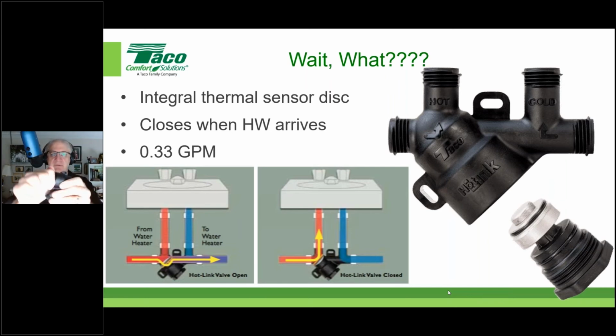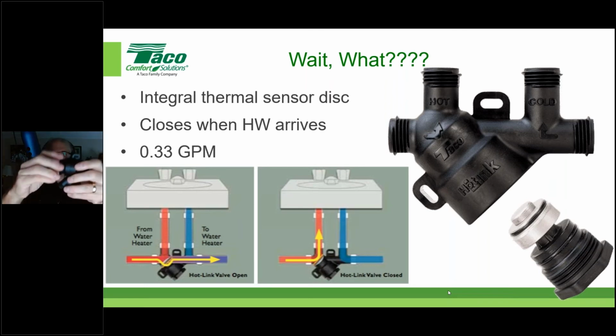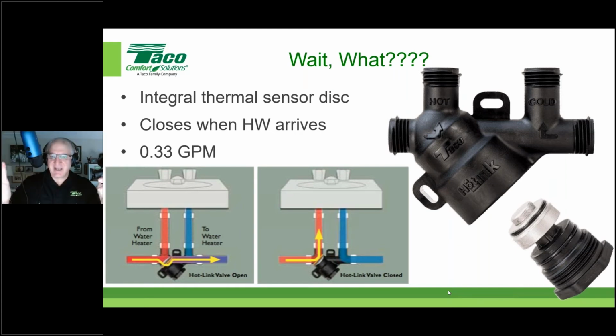Right. And what do we mean by hand tight? Pretty simple. Again, you put it in, as we show here, it's really loose. Now you're gonna hit some resistance here. Just keep going through the resistance until you hit a hard stop right here. Now, right now I can't move it with the same level of effort. That's tight enough. It's watertight. It's tight enough, and we're good.